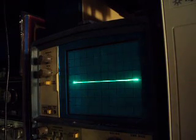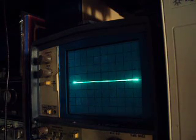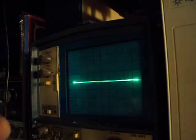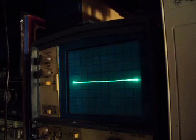Here's a 4.7 microfarad capacitor — it gives a nice elliptical trace no matter which way you connect it. This is an AC probe. Here's a 22 microfarad capacitor that's a good one. There's also an old capacitor I found on a 1960s board — it's 20 microfarad. Notice it's leaning over; that's the indication that there's leakage involved and it's not necessarily healthy.